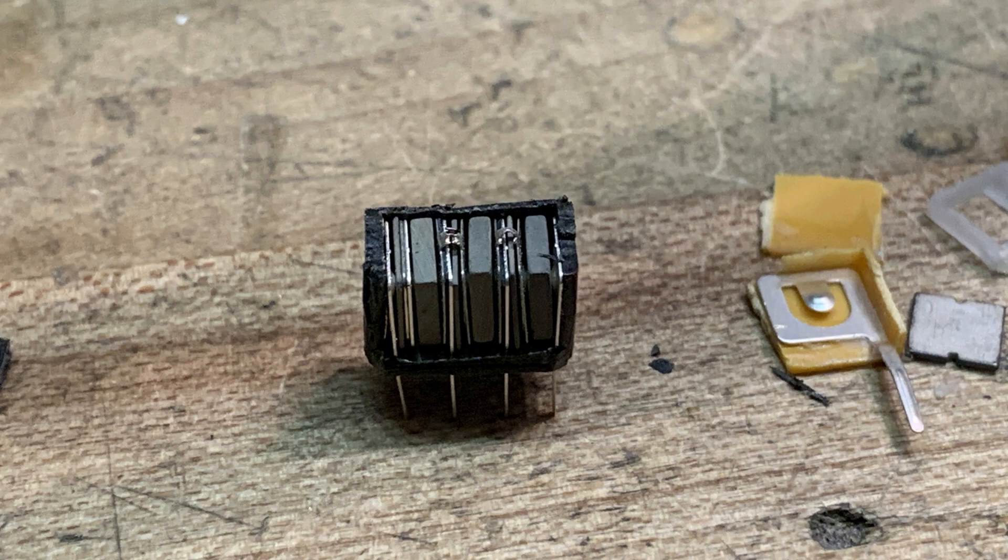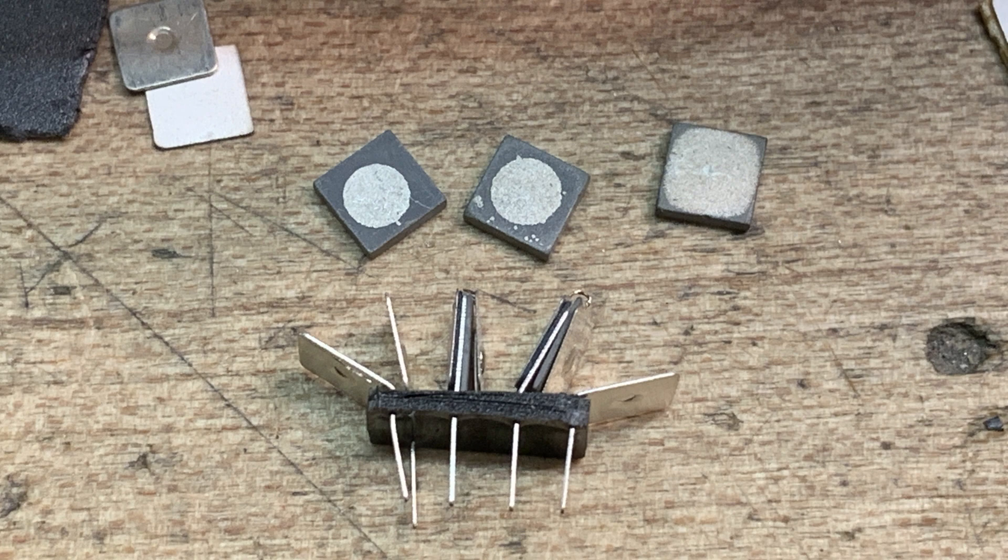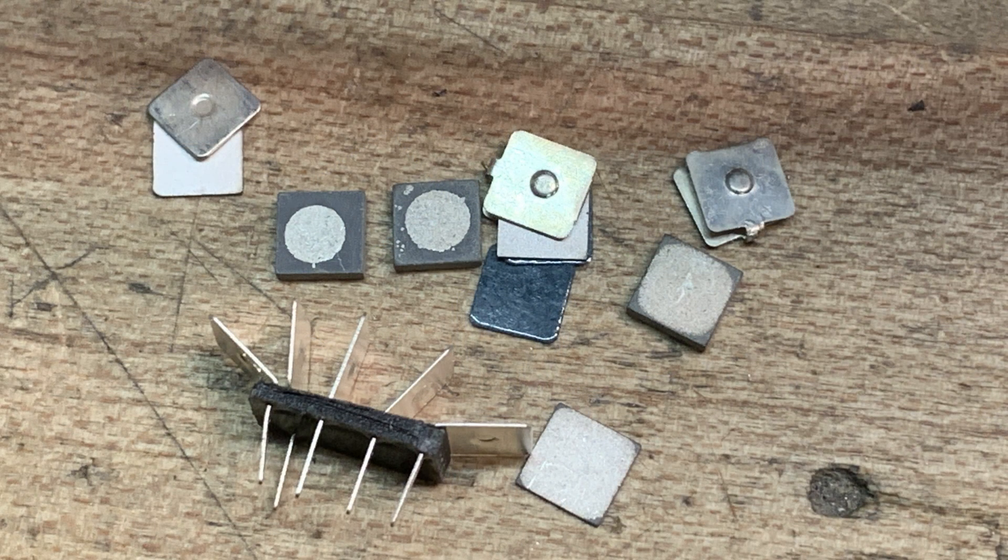If you keep peeling it open, you can see the construction: big slabs of ceramic, then little tiny dielectric spacers, and then a piece of metal folded over the other three legs. The three legs end up being a big slab of metal, and the little metal contacts that make contact to the resonators fold over a small piece of insulator and act like a capacitor. The ceramic slabs have different little circles on them — I don't know how that works or how it changes the frequency or response, but somebody probably knows — comment below.